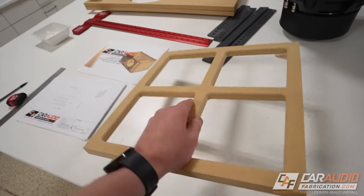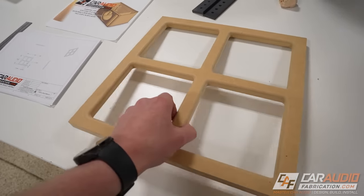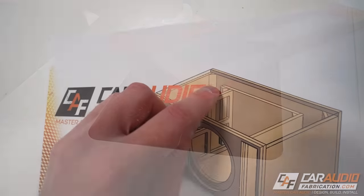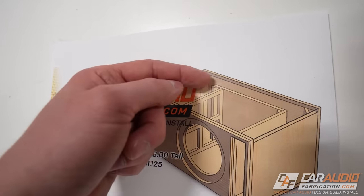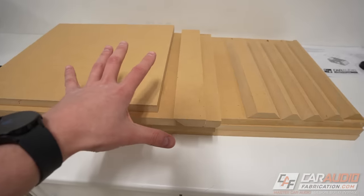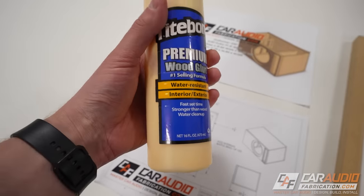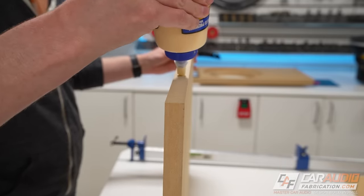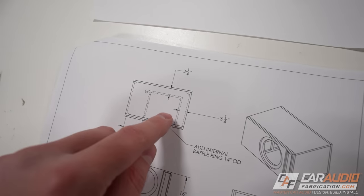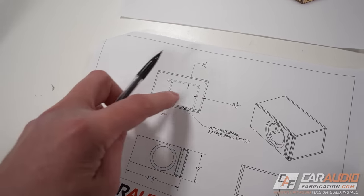Now we need to do some detail work to these pieces. First, we're going to load up a roundover bit and apply a rounded edge on the inside of the window brace. After adding those roundovers, this has much more of a finished look, and it also allows air to oscillate back and forth over that surface more efficiently. There are several other areas I want to apply the roundover treatment — around the outside of the port opening, on the end of the inside of the port, on the port brace piece, and on the corner of the port piece. Now all our different pieces are ready to go. We've got all the detail work done, so we can begin the assembly process. The biggest tips here are to use plenty of wood glue with 100% coverage on each mating surface, and to make sure everything is square throughout the assembly.